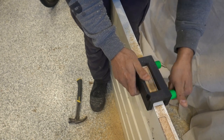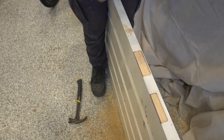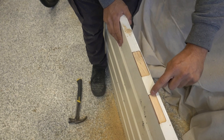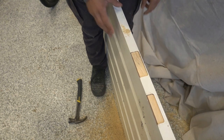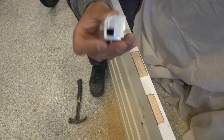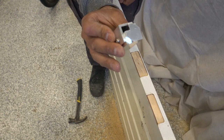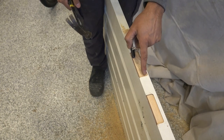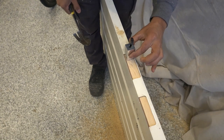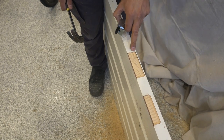Clamp that off and now we've got three perfect cutouts. The only thing missing is that because we used the router, we've got rounded corners on our 100mm and 85mm. So I'm going to take a corner chisel — which I never even knew existed, thanks to Jeff who's actually the creator of this jig. What you do with a corner chisel: if you've got a rounded corner, take it, slide it into place, square it off, give it a tap, and that takes out the corner for you.